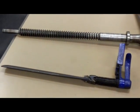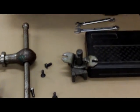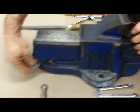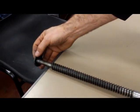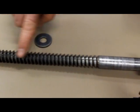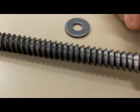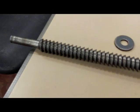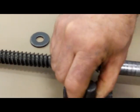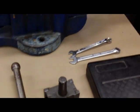Place all parts to one side so you can see them and you'll know exactly how they go back together. Turn the vice back onto its base — remember there's a washer fitting inside there which will fit on the end of the shaft when we reassemble it. Note the different shape on the buttress thread: it's very sharp on one side and tapered on the other, which allows the block to slide and lock back to the main part of the vice. We're now going to slide it out.